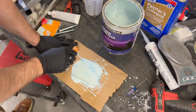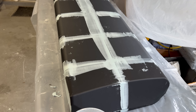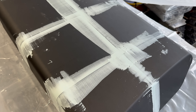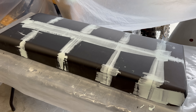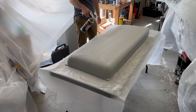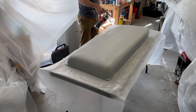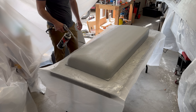The panels mostly lined up, but you could definitely see the cracks between them, so I slapped on some finishing glaze left over from painting the race car. I do want it to blend in a little more than black with body filler smeared on it, so I decided to go with truck bed liner. I found a color that looked like it might kind of match, and then I painted it. This was super easy — it masked all the imperfections, and I might just use bed liner for everything I paint in the future.